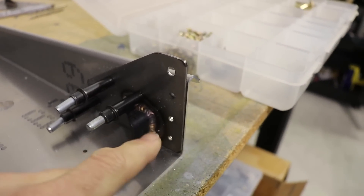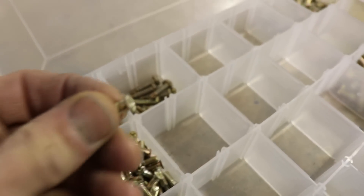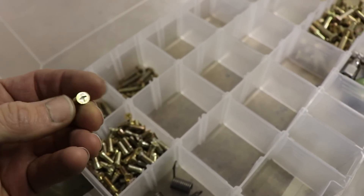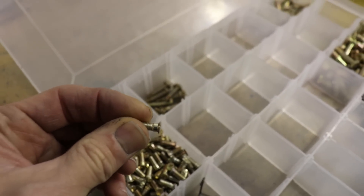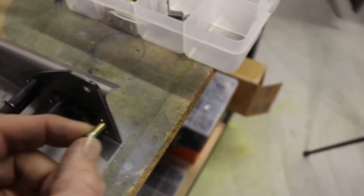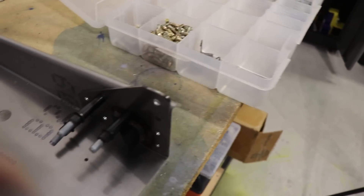So I'm going to do the same thing I did on my cruiser. These three holes I'm going to drill out to three-sixteenths and countersink. I got these screws from the Guard — they're from the F-16; we use a thousand of these on the canopy and various other things. It takes a special bit, not a regular Phillips, but it's just a small screw made to go into a countersink hole. I'll put a bolt and nut on it instead of a rivet so the bolt head will be flush with the steel, and every time the seat back moves, it won't be rubbing on anything.